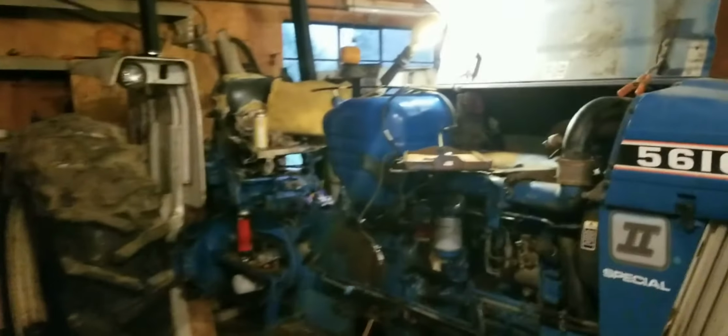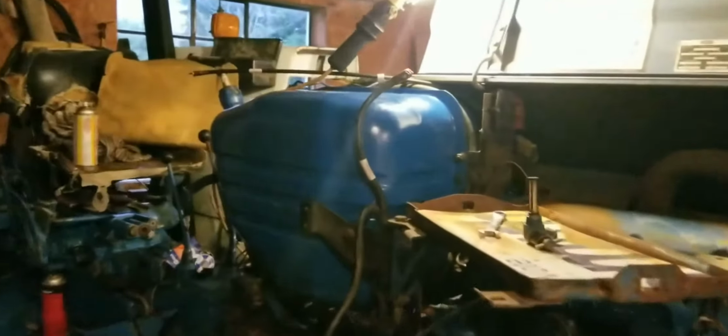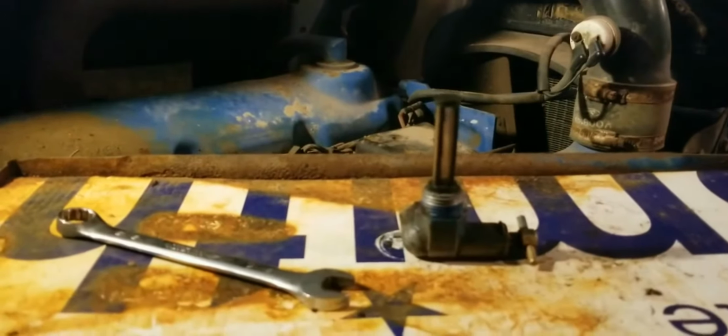So I figured tonight, what I need to finish here is just bolting on the gas tank. I got all the bolts basically on and threaded. Nothing's tightened up. Let's see, there's one there and there, and I think there's some down there. And then I need to put that in the bottom of the tank. That's the shut off, and it's got a little filter that I ended up cleaning out. Get that on there, and then hook up that fuel line, the supply line.